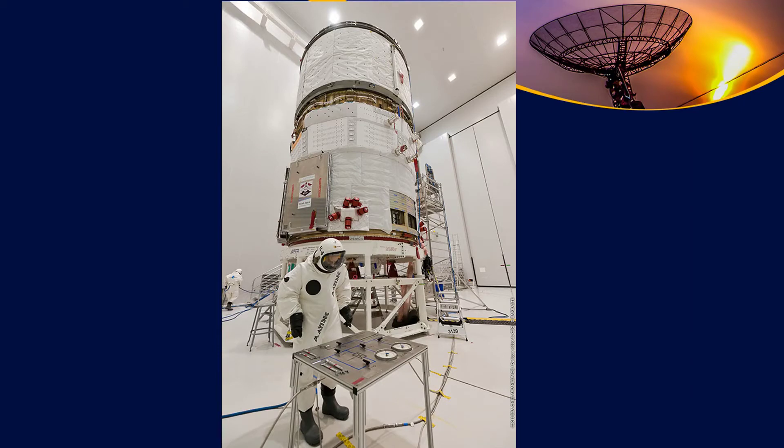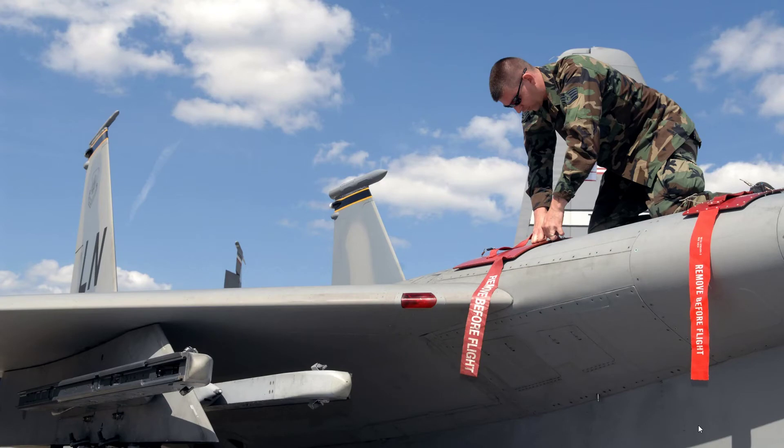The next thing you'll do is fuel it up with whatever kind of fuel you're using. If you're using anything remotely dangerous such as hydrazine or any rocket fuel, you'll have to fuel it at the site. If you're using a pure inert gas such as xenon or compressed nitrogen, you might be able to fill it at your home location. This is one of the ATV vehicles that the ESA built, being filled with hydrazine. You can see the almost spacesuit-type gear they're wearing — hydrazine is a very nasty substance and even a small amount can cause serious damage.